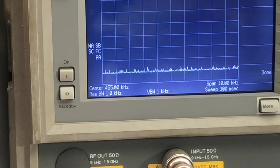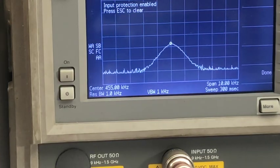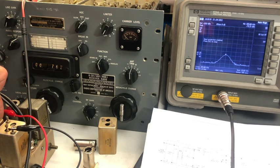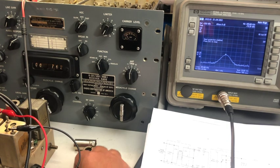Okay, why is it doing that? Might it be that it needs the shield? Let me see what's happening. I am discovering something very strange. If I remove this shield I'm losing the signal — if I slide it in, can you see that? So it seems that those shields are part of the IF alignment. I wonder if there is some wrong contact or position that is causing this signal loss on eight kilocycle.